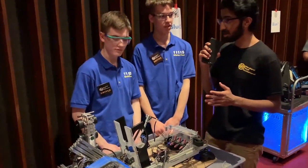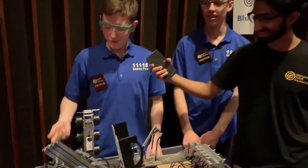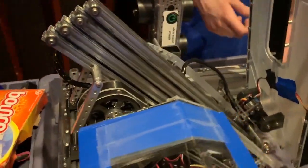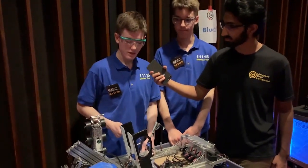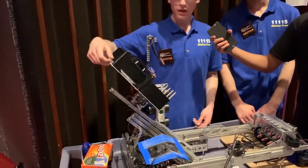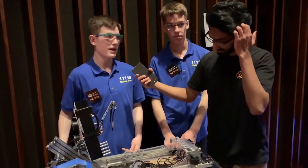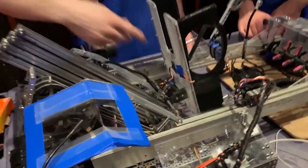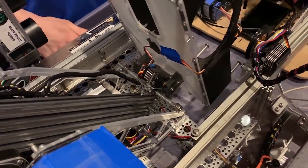That's an amazing design. How did you get those REV slides so fast? We used a 3.7 and a 2-inch spool, which gives a really high tangent velocity. To get the slides themselves smooth, we picked up a trick from Kraken Pinion 8680 — they didn't use the middle screw in the REV sliders, which gives a lot more play. You can see in our design this can wobble a ton, and it actually slows us down sometimes. But that play means it can slide much more freely, and as long as it's not oscillating back and forth, we can drive it really fast because there's very little friction. To compensate, at the bottom where we need precision, we have separate bearing rails. This keeps it from wobbling so we can make the exchange accurately while still reaping the benefits of not having the middle screw in the slider.